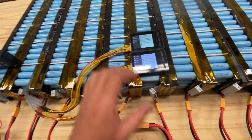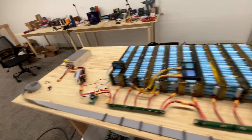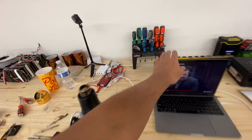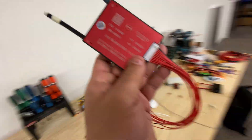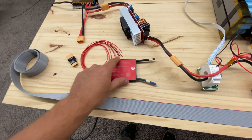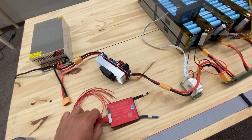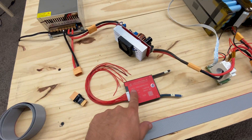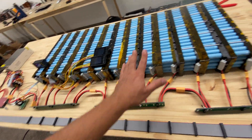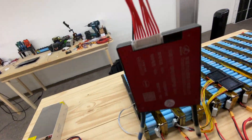Depending on where the average group ends up, I'll decide to do a balancing thing, because this can balance here. After that we'll put these all in a box. Then I'll go over the BMS. I think I'm going to use just a little BMS — something like this. What I'm going to set it to do is just turn on and off a switch. When the BMS turns off, it's going to turn its MOSFETs off, and that's going to turn off an actual switch that will turn the battery off. The balancing will happen by the tiny little circuits inside of this one.